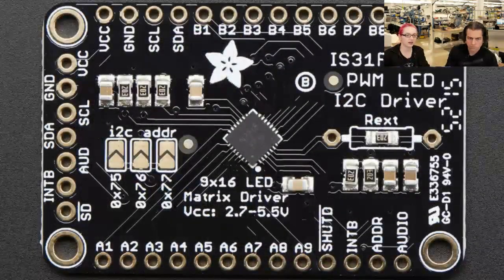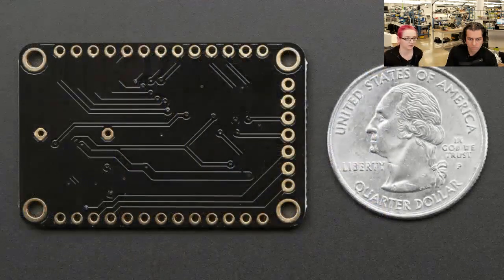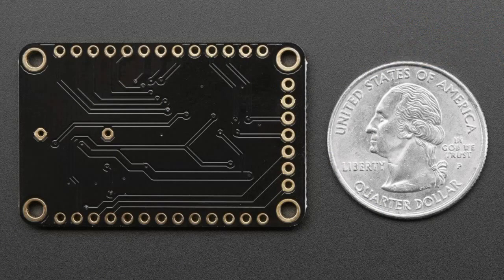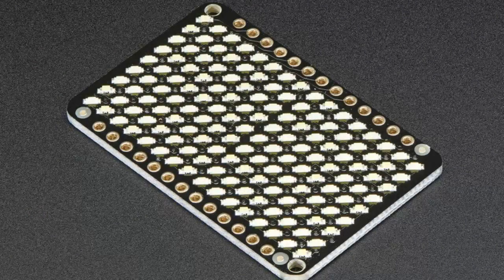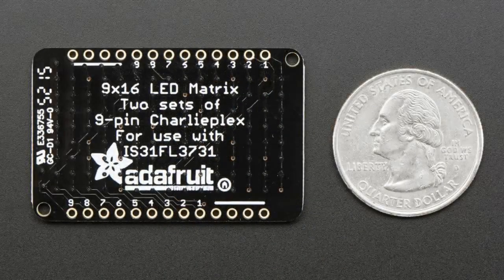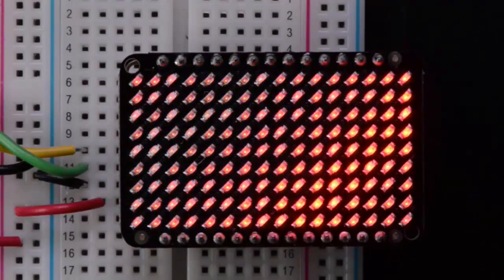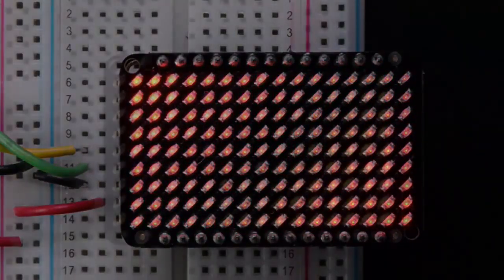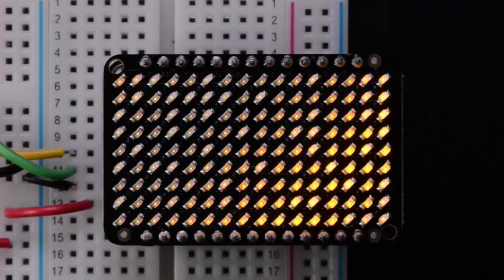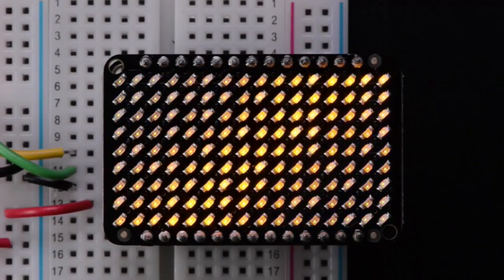You can DIY your own matrix following the schematic in the datasheet, or pick up one of our ready-to-go LED matrices. We made the LED matrix first with 0603 LEDs, then made the backpack so it fits perfectly on the back. We have it in red, and this demo shows a swirl — it shows you that it can dim the LEDs, which is very rare. Usually with an LED matrix you can only have LEDs on or off, or dim the entire thing. This individual dimming is a big deal — I've never seen a driver that does this.